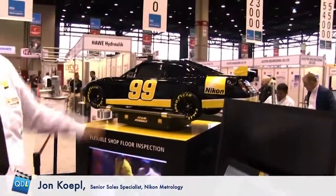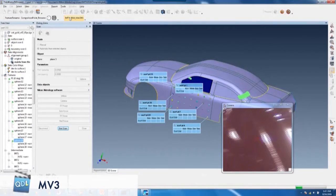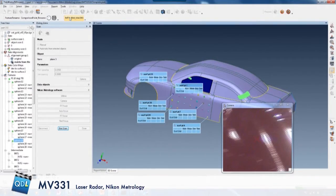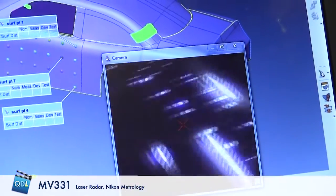Are you measuring distinct points or doing a complete surface scan? A little of both. Here you'll see we're taking measurements on the C pillar of the car - it measured a cylinder, now it's measuring the C pillar. You can't see the red dot as it's measuring, but on the screen you can see it's doing a scan over it, and that corresponds to the model.